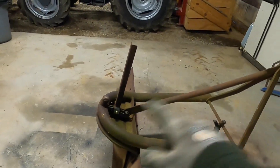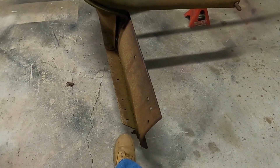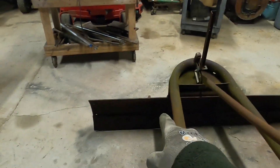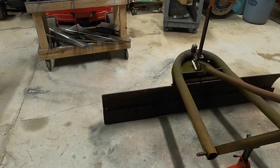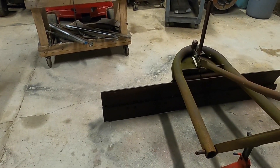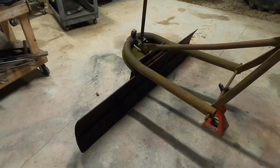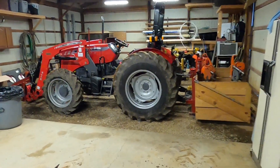I'm going to take this apart over here and just get it down to the bare blade and possibly this reinforcement, and find out what I need to do. I would like to take this from six feet, come off the ends of it with a little bit of an angle and then add the ends to it, to get right about seven feet to cover the tire tracks on most normal utility-size tractors. With the way we've got them set up, between his Case and my Massey, I think it's right at 83 inches. So if we can get this around 84 inches, I think I'd be pretty happy with it.